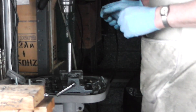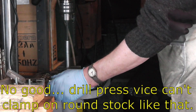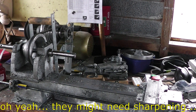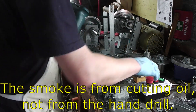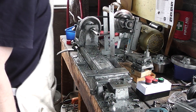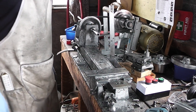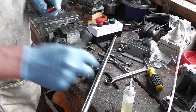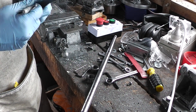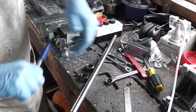I'm going to plan D — drill press. Didn't want to use this because it'll mean extra setup. I think I may have to end up cutting this off, because these drill bits are not going to reach through. The book says to make the stock about 101.6mm long; from memory I might make it 120, just to give myself a bit of tolerance.